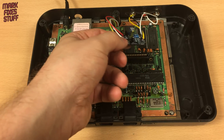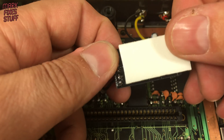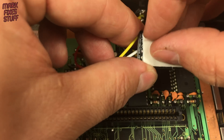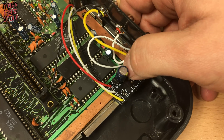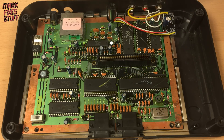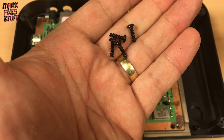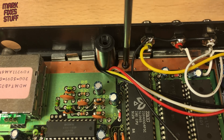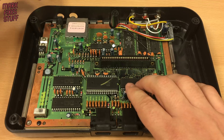We need to find somewhere to mount the board inside the console. I'm going to use some double sided foam and stick it near the RCA ports. With the board installed it's time for some screwing action. Luckily I have a big bag of screws all the way from China — these are M3 screws, 10mm in length. They're very useful for a lot of retro machines and will also hold the case together at the end.